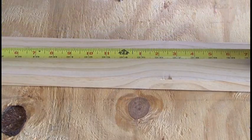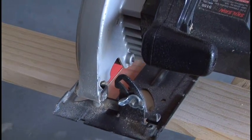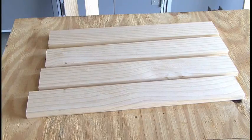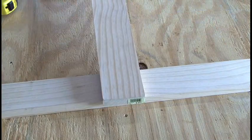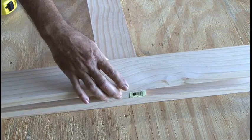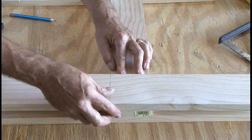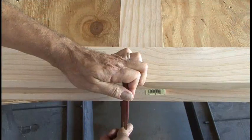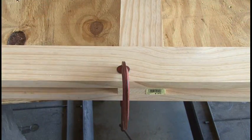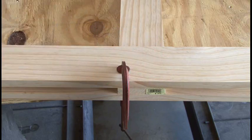The actual feet for the sides will be 2 feet, so I'm going to cut four 2-foot feet out. Each of the 4-foot sides will be sandwiched in between two of the 2-foot feet to form a stable base. After finding the correct location, I'll lay the three pieces of wood together and clamp them, and I'm going to use two 3.5-inch bolts with nuts and washers to secure them.